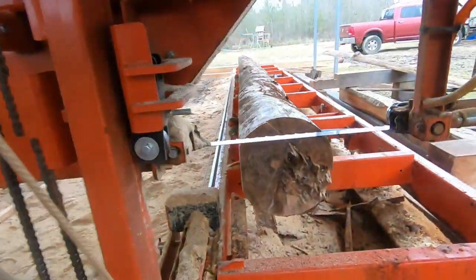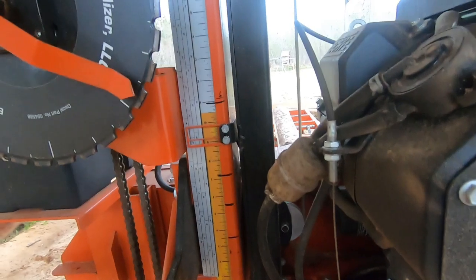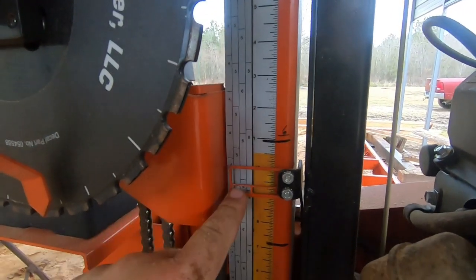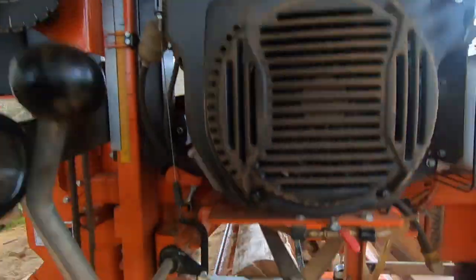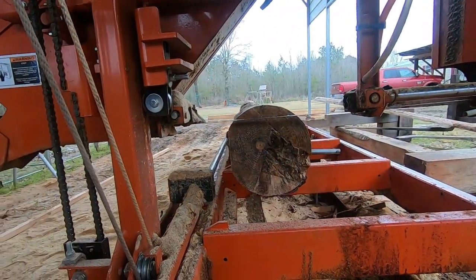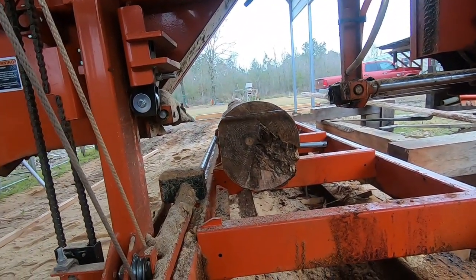All right, let's see where we're at right now. I know I've got a flat bottom — I ain't going to get nothing there. I'm going to come down until I hit a six. See this six right here? That line — I'm going to cut on that six, which is right there. Let's see what I got. I should be able to get a board below that, and that way I'll have me a flat side. Then I'll flip it again and cut my width for my two by six.